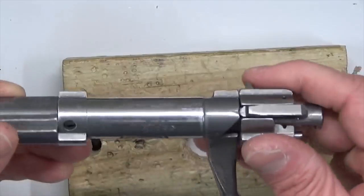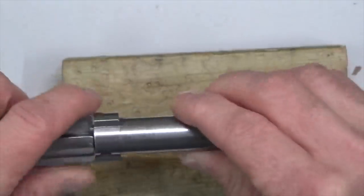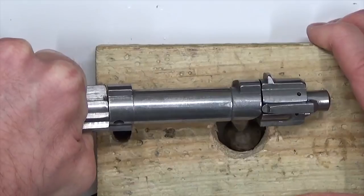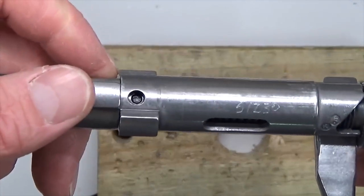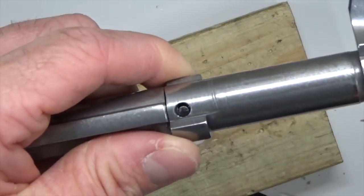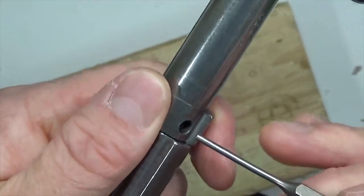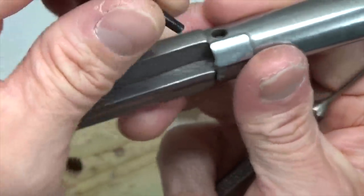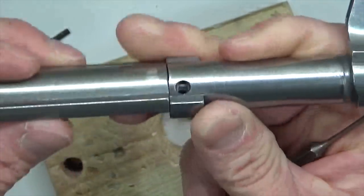We're in this little divot right here. What we want to do is line up the breech block retaining pin with the hole to allow us to remove it and separate the bolt. We'll rotate the breech block so the cocking piece moves out of that little divot onto the smooth portion, away from the big hole. Look at that — that pin is lined up with the holes on the bolt itself. There's a side with a squared head and a side with a circular head. Push on the circular portion to get that squared head up and out. There's our breech block retaining pin.